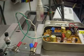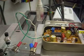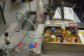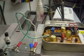Over here I've got three LEDs. The first one on the left is power. The one all the way on the right is a ready light that flashes when the circuit's ready to detect touchdown. The light in the middle is touchdown. The black button is power on and reset. The one behind it in red is a preset button that stabilizes the high gain amplifier.